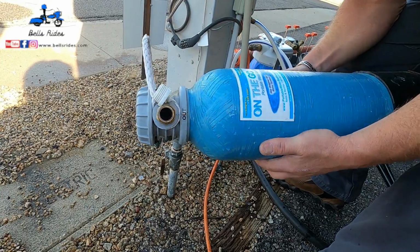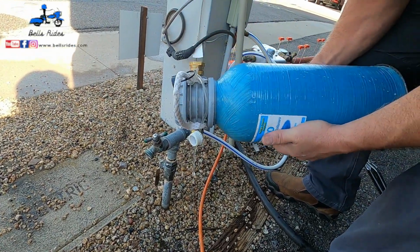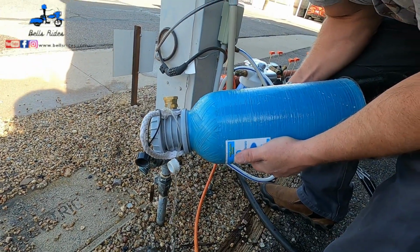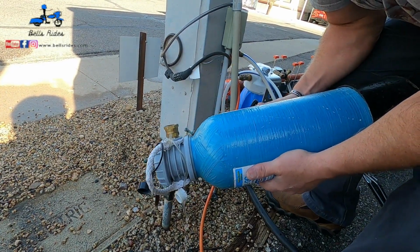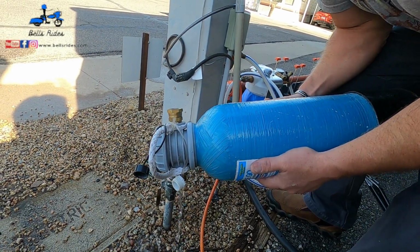So after backflushing, you dump out the remaining amount of water that's in there before you can charge it. Well, because you have to have somewhere for the salt to go, space-wise. And if you don't dump the water out, then there's nowhere for it to go in.